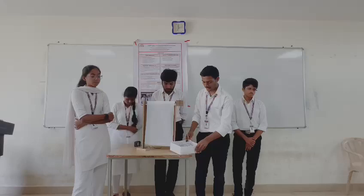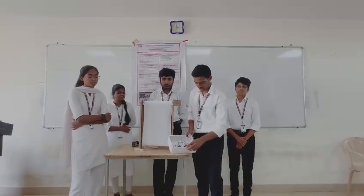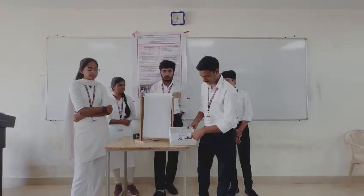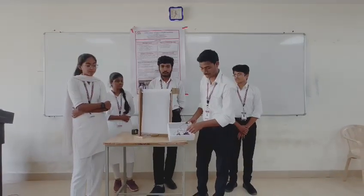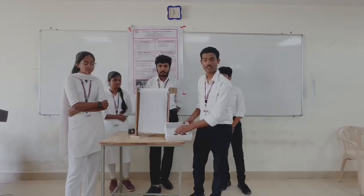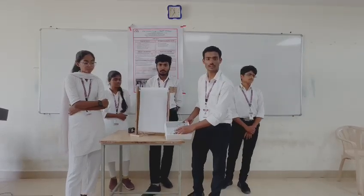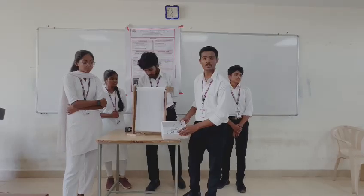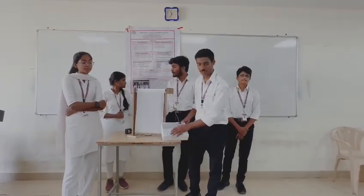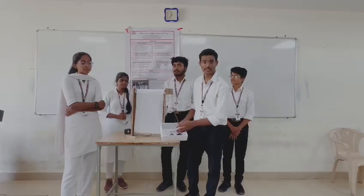As you can see in the video, the potentiometer is connected to the Arduino and can be controlled with its help. The outputs of the Arduino are given to the motor driver because the motor requires 10 volts, but the maximum output of an Arduino is only 5 volts. So in that case we used a motor driver as an external power source.